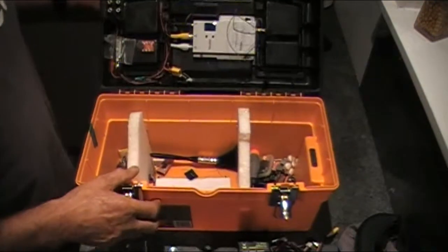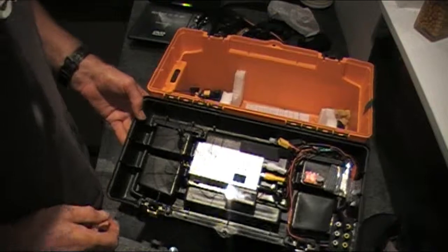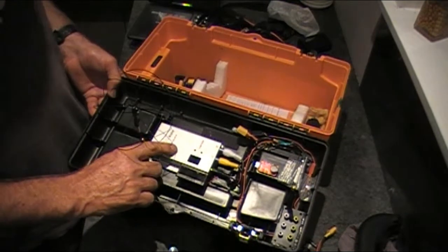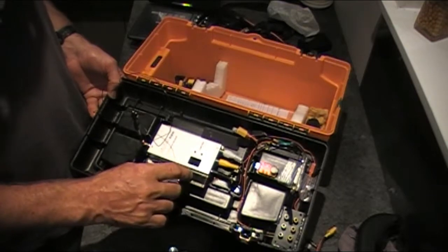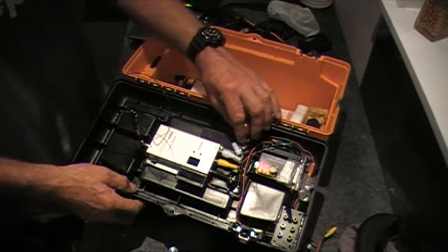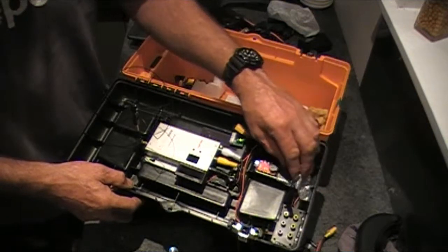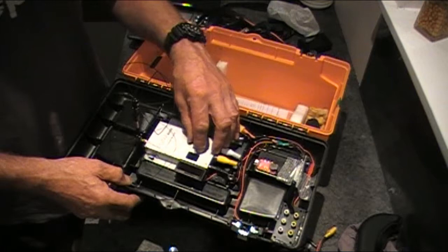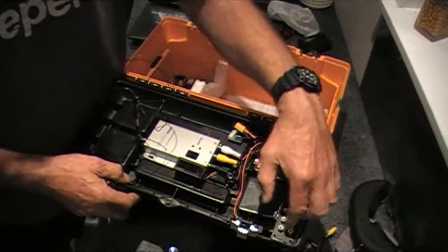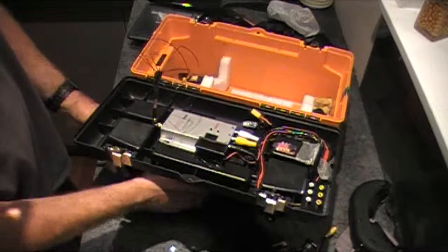In the lid we've got the aerial and the 12-channel receiver. There's a digital voltmeter for the receiver which goes back to your power supply, a filter for the Fat Shark, and a battery checker. It routes 1.3 gigahertz in from the plane to 5.8 gigahertz out to my Fat Shark goggles - the standalone ones. There are also a number of plugs here for AV and sound, and it works extremely well.